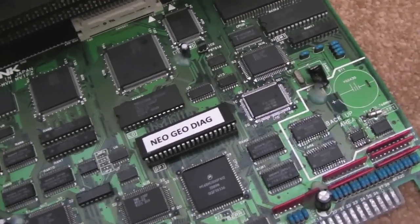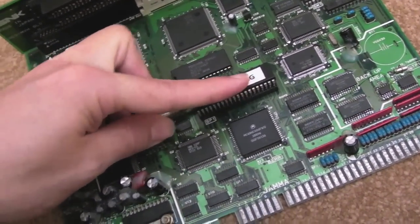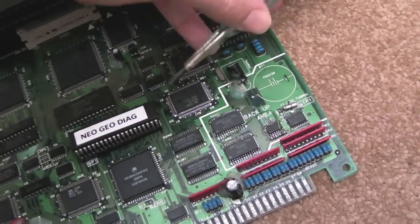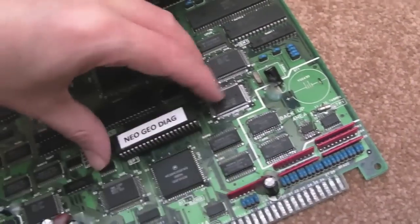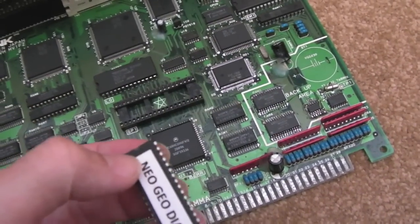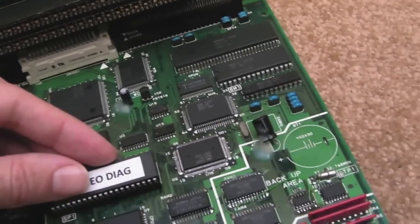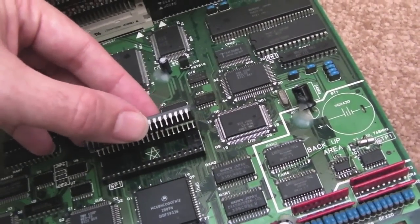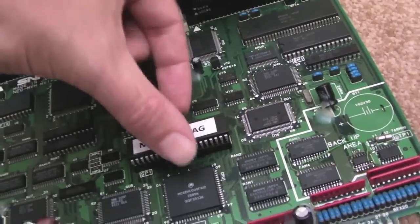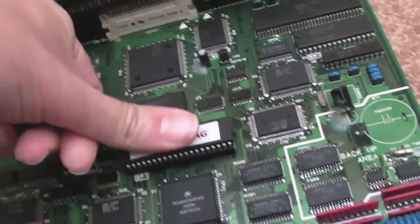As you can see, it's stuck in this corner here a bit, so it's a case of just levering that side on its own, just making sure you support the rest of the chip while you lever it. There we go - final step, just to get that side out. Sorry, it's not easy with one hand. You can see the pins are all nice and straight there. And that's the key: not to bend the pins. And whenever you take these out, you can see there's a notch there, and it's also marked on the board. Sometimes it's marked in the socket. So you've got to make sure you put it back in the same way. When you do these, the best way is to align one side first so all the pins are definitely in there - visually inspect it, then check the other side - putting a bit of pressure onto the opposing side, just making sure all the pins are in there. Double check it, and then just press it in.